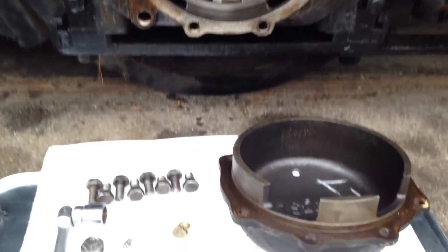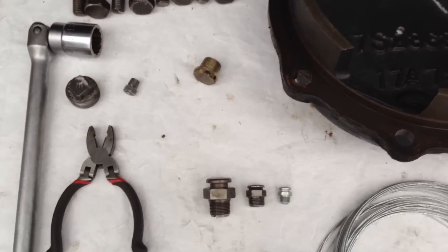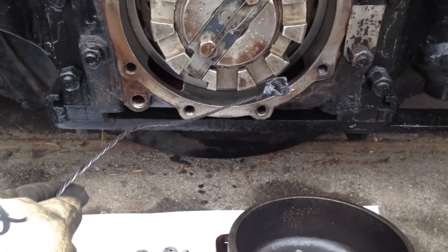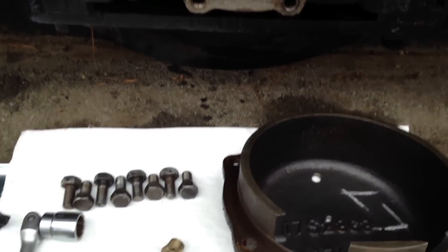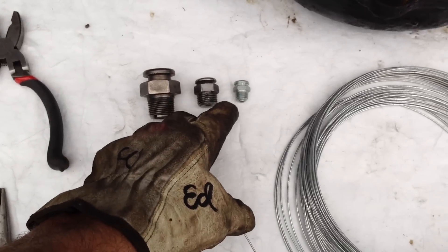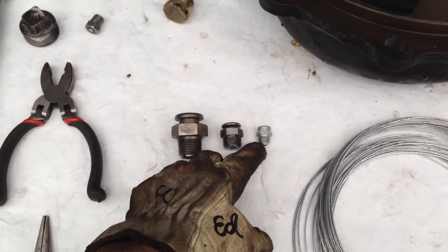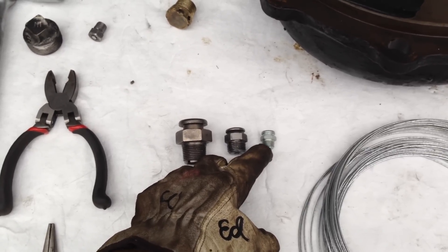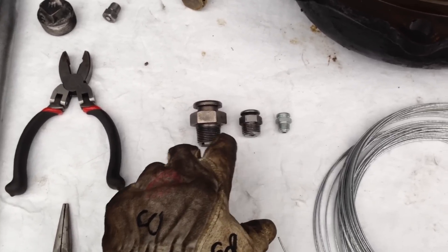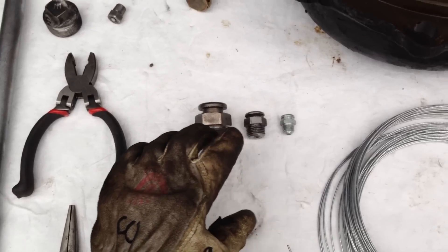You can see a lot of the hardware down here. We've got the cover — it's been cleaned, inspected, and is ready to go. The cover bolts and special tooling that we've made to reach down into this lower cavity and help scoop out as much of that old grease as possible, so we can replace it with the new lubricant. We have three sizes of button heads in use on the locomotive. These are brand new — we have those in our inventory and brought them with us, and we will replace all of the button head fittings on the locomotive. The intermediate size and the large size have been cleaned, disassembled, reassembled, and are all ready for service.